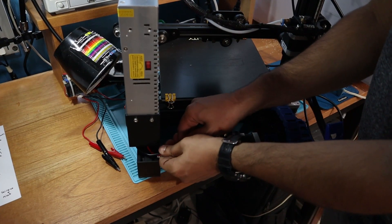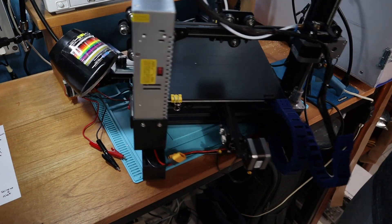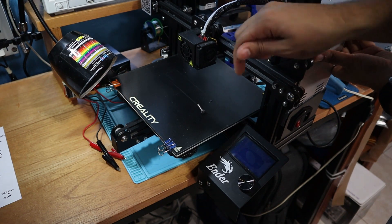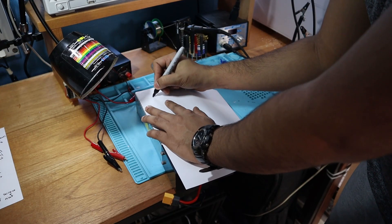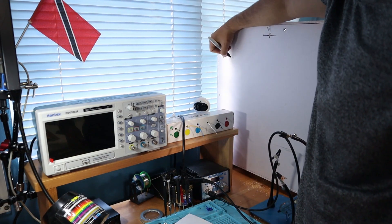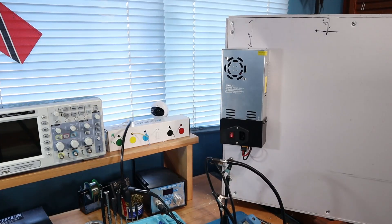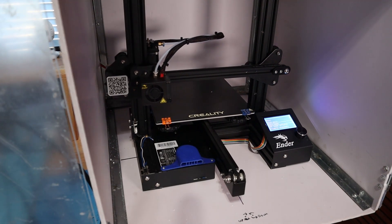The last thing was to move the power supply outside. It connects via an XT60 connector — using the supplied Allen keys I removed the 24-volt power supply, saving the screws. I templated the holes at the back and lined up the power supply 3 inches from the top. I used five washers as spacers since the screw holes are shallow, to avoid damaging the supply. I made a small hole to pass the XT60 connector through and fired up the 3D printer. Now we have a fully functioning 3D printer enclosure — but let's not stop here.